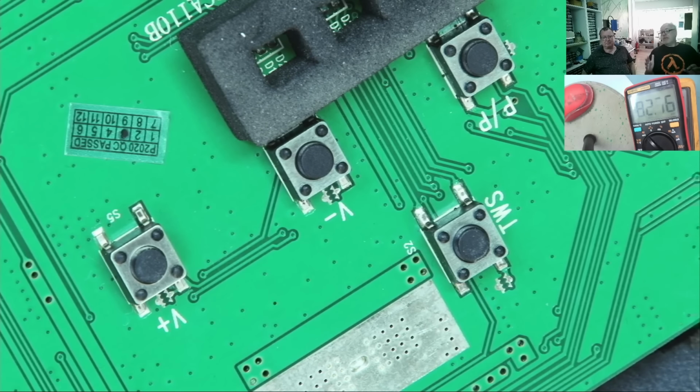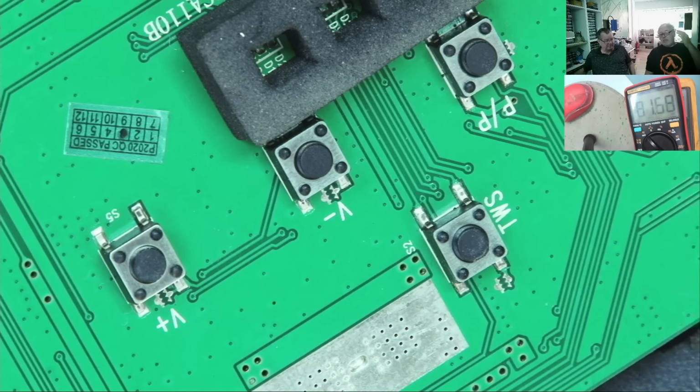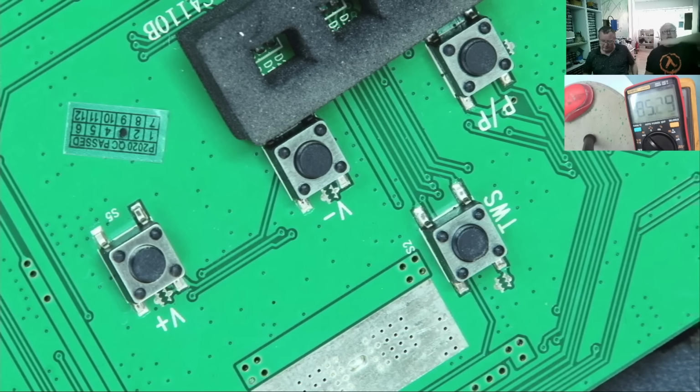Yeah. And these are hard. I normally avoid these. If I see there's a ground pad that must be connected, either way, I choose assembly, because I don't want to do this by hand. Exactly. Or I try a different chip. These parts are normally there for thermal connections, but there are chips that simply have the pad without any connections. It doesn't matter if you connect anything to that.